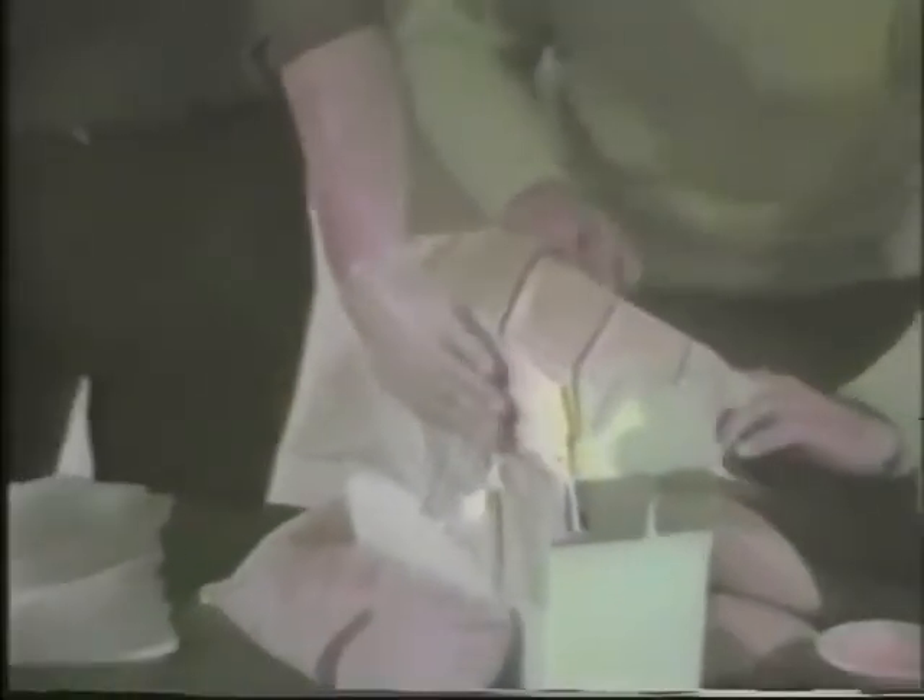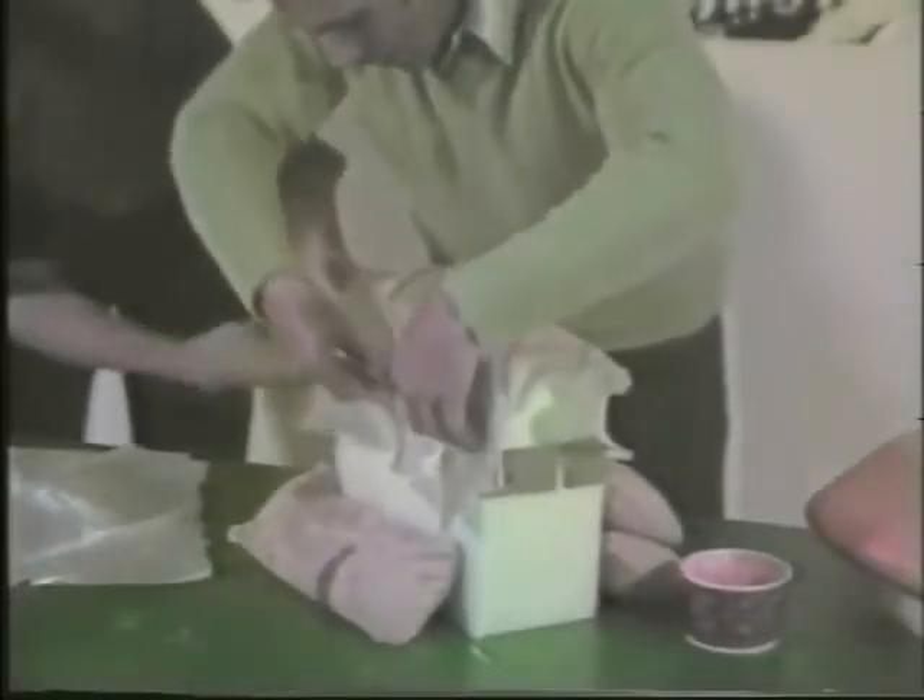Notice we made the glass quite a bit too long, and now we'll just scissor-trim it. It's okay for it to be a little bit short. If it's too long, it will build up into the corner and cause a disruption that'll get in the way of the spar cap. Get some epoxy in this. If you just take your fingers and run it into the corner, it'll crease the glass, and you can pull it away and cut just short of the crease. It's better to be a little short — you do not want the glass to run up into that little corner. You can be as much as a half inch short without any problem at all.